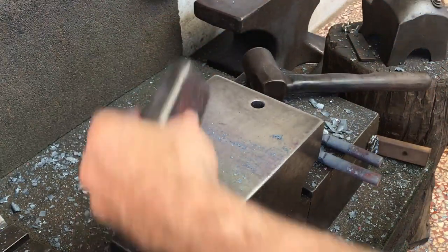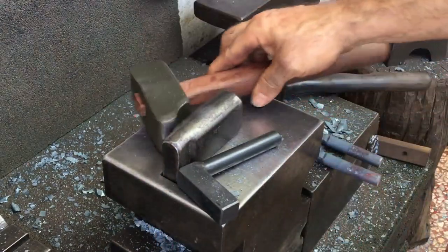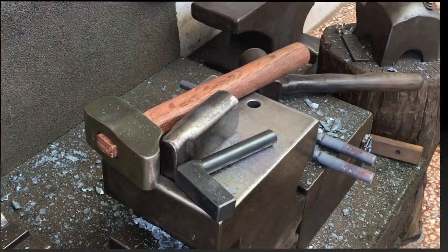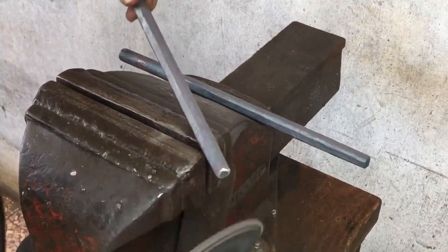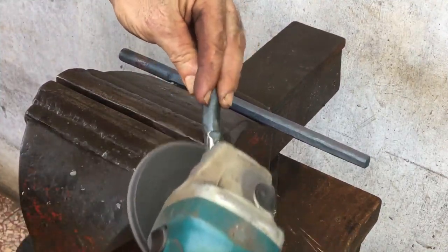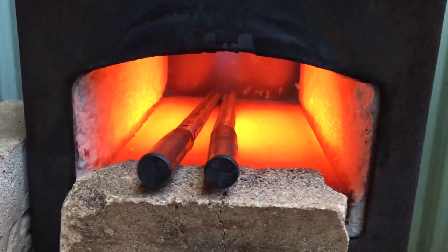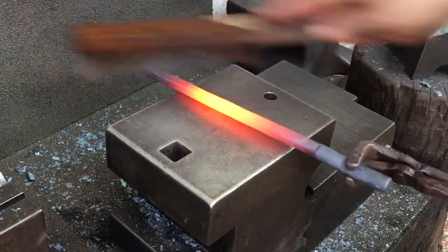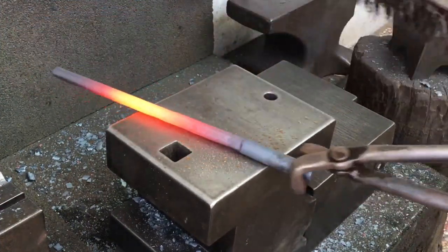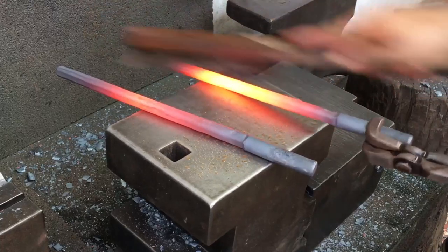Currently I'm working on a simple top and bottom swage system that would allow me to get close to the diameter I want and also return the shape to round — that may make an appearance in my next video. With an operation like this, the amount of scale is way more than I'm used to. Since my top and bottom swages aren't complete yet, I decide to just grind the handles a bit smoother. Doing this should segue nicely into my next video where I plan to use these blanks to make a special tong. Just a simple one today, but a good reminder.